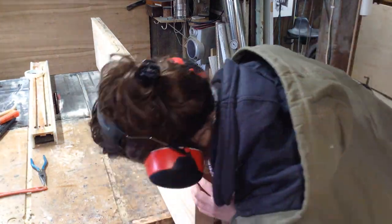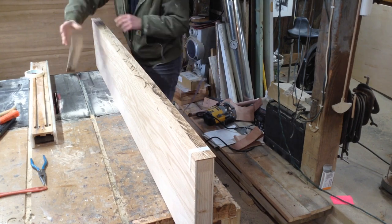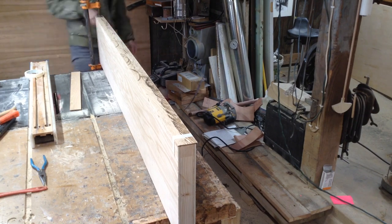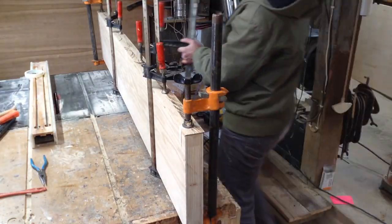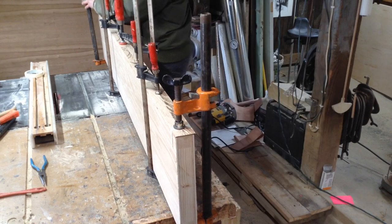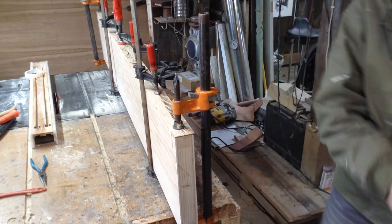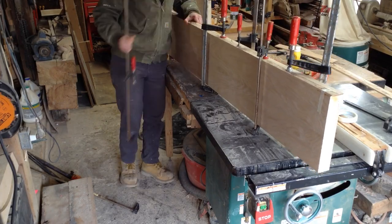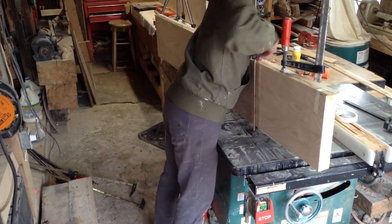This lumber isn't bad lumber. I didn't need a ton of it, so I bought red oak at Lowe's that's already planed and jointed, which makes life a little easier. It did come out a little bowed, so I needed a lot of clamps to make sure I didn't have any gaps in the front. I let this set up and then glued the face of the second one as well. Since it was still pretty cold out, this took about a day per shelf, but the customer was in no rush so it worked out.